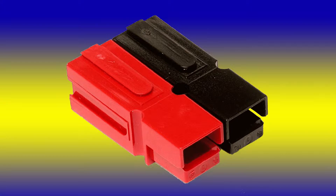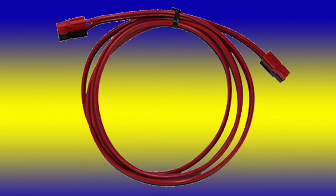First, some types are not completely sealed, so they need to be placed in such a manner to prevent any object from dropping on their potential exposed connector, however unlikely. Secondly, some of the various models are marketed using pre-installed cables, which are usually too short and require butt splices to attach them to the power source. Extending the cable's length also increases the I²R losses, so proper sizing is important. If possible, choose one without a built-in primary cable, and add your own in an exact length and size required.